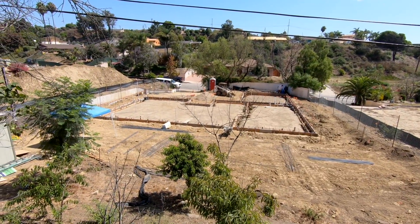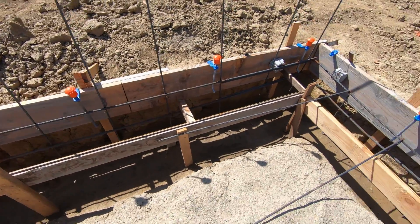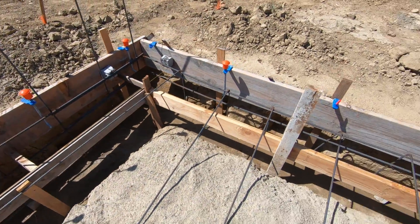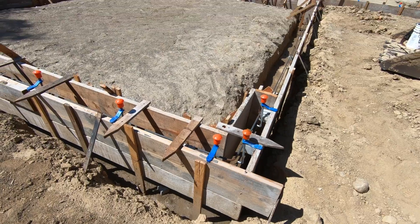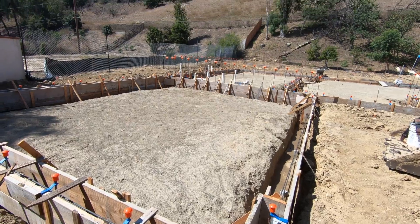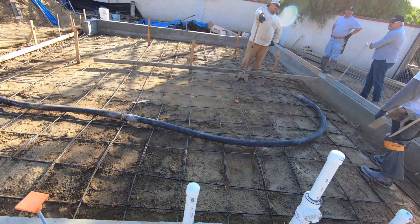With this particular home that we're building, California Pre-Cut Homes allows me to design a home that the customer wants. Basically what we're seeing here right now is the makings of a new slab, or the foundation for the house. We're going to pour a footing, then when that sets up, we will come in and pour the slab. We'll let that set up, and basically we'll build the house right on top of that slab. But we're going to use our panelized system — this is a new, state-of-the-art, advanced way of building a house that's not modular. It comes together a lot faster, and I'm going to save my customer a lot of grief and a lot of money.